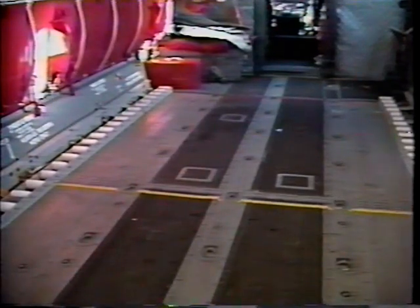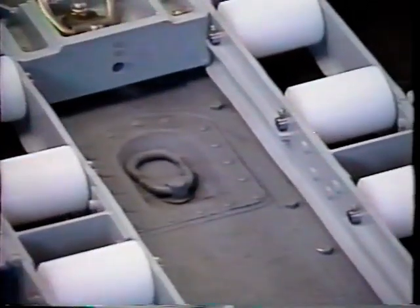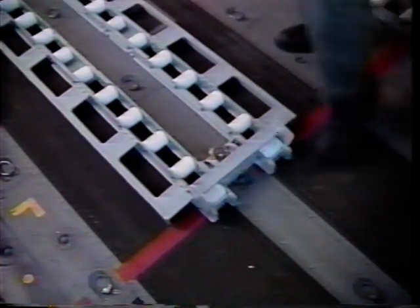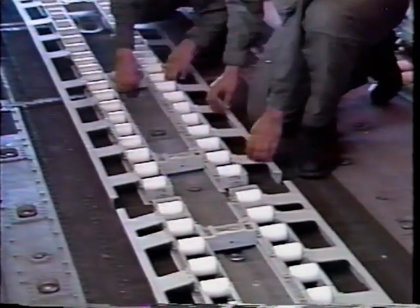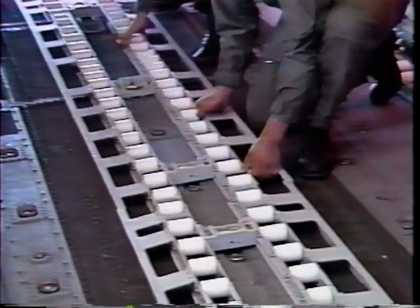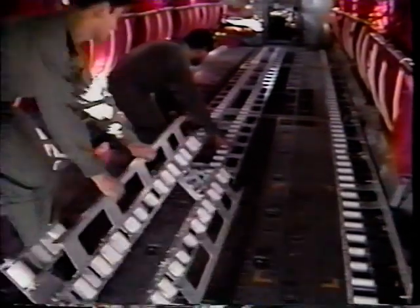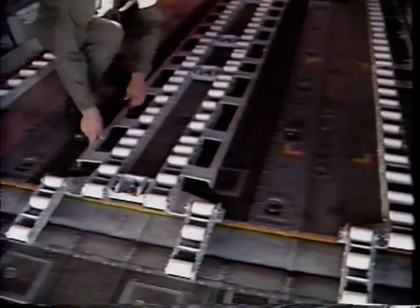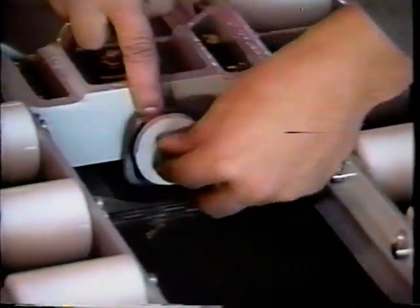To install the inboard roller guides, position the forward inboard guide roller assembly on butt line 0.000 so that the forward end is aligned at station 157. When installing all inboard roller guides, ensure that no 5K tie-down ring is blocked. Position the forward hatch inboard roller assembly on butt line 0.000 directly behind the forward guide roller assembly. Position the center and aft inboard guide roller assemblies sequentially behind one another. Connect tie-down assemblies to the 5K tie-down rings on the helicopter floor using centerline ring plug assemblies.